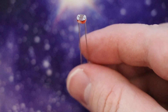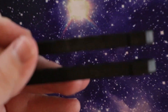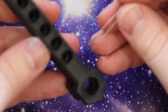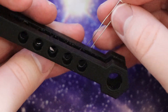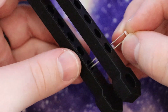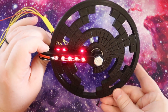In my prototypes I've been using photoresistors, which are components whose resistance changes based on the amount of light present. I created a reading arm for the encoder that was approximately one segment wide and added 5 spots for 5 different photoresistors. My hope was that segments where material was present would block enough ambient light to get a good reading, but that didn't quite work out. A human could fairly easily see which bits were high and low, but I was worried about misreadings in code. As with pretty much all good things in life, the solution was lasers. Lasers shining focused beams directly onto the photoresistors led to readings so stark that it was impossible to mistake.